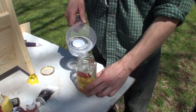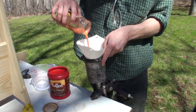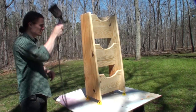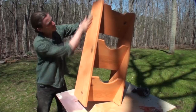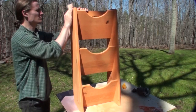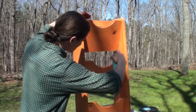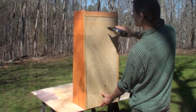I began by adding some color, water, and shaking up the mixture. Filtering your paint makes sure you don't get any lumps or clumps into your spray gun. I first dusted the piece off without spraying paint, and then shot a little color on the back side to make sure it looked okay. I then moved around to the side and the front. I sprayed on several coats, and then wiped it down to even out the color. The piece was then lightly sanded with 320-grit sandpaper just to knock off the fuzz, but not enough to wear through the orange. I applied a top coat of Minwax polycrylic, a water-based finish that comes in cans for brushing, and you can also purchase it in spray form. And last but not least, nail a piece of quarter-inch ply into the rabbet on the back of your piece.